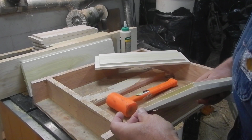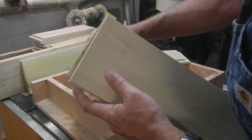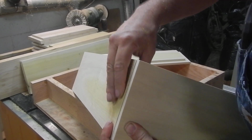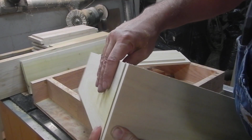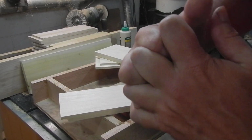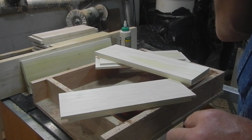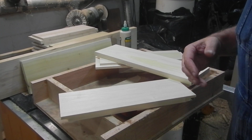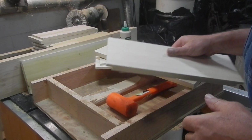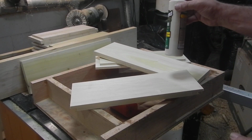We're going to show you how to do this with rabbet joints. Now, the nice thing about a rabbet joint is when the two pieces of wood are nailed in, they leave a vertical drainage line. Unlike your finger joints, which leave a lot of spaces for water to collect, and that's a common problem with box joints. Now, a box finger joint is a stronger joint than a rabbet joint, but if you're using good glue and properly build them, it really shouldn't matter.